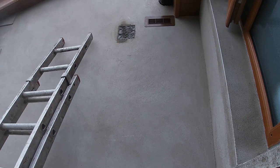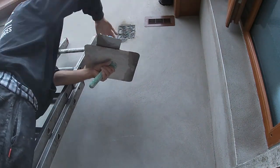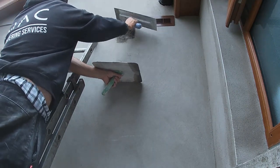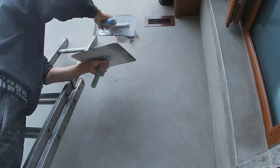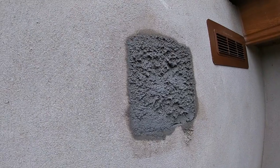Back up to the large hole — it's a bit awkward because it needs ladders. When you are on ladders filling in patches or extractor fan holes, always set them up safely and correctly and don't take any silly risks. That's my scratch coat that I mentioned, and I just need to put one thin coat layer on now. Sometimes when you try to put too much on in one day it could end up a disaster. My idea when there's depth like this is to put it on and leave it all open so the sand cement has a chance to dry up and let air into it, which means it'll finish much quicker.